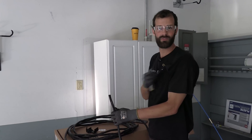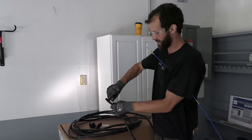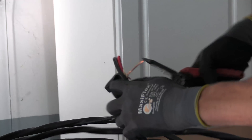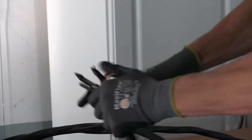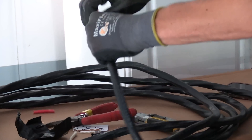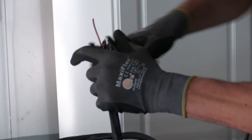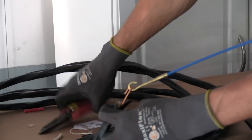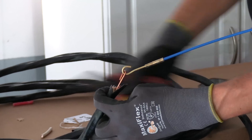Let me show you how to connect the cable reliably to the hook on your fish tape. I'm going to strip it back at the grounding conductor — it's solid copper 10 gauge, which gives a great connection. Using a copper wire cutting tool, trim off the other conductors. Pinch it down and smooth the edges so the cable pulls through the hole cleanly. I recommend using a self-feeding wood bit and making at least a seven-eighths inch hole for smooth cable pull. That is a reliable connection that will withstand a lot of force.